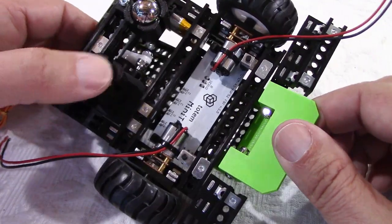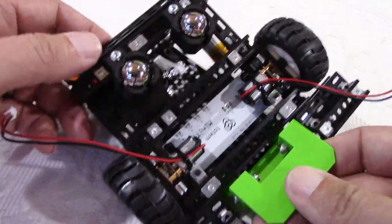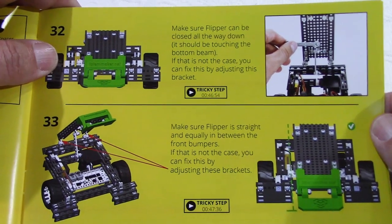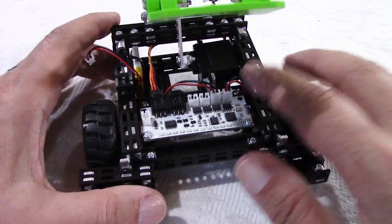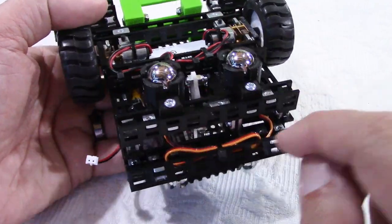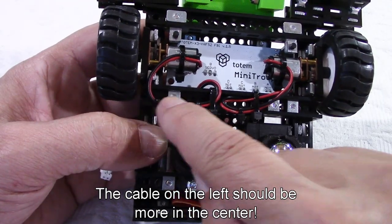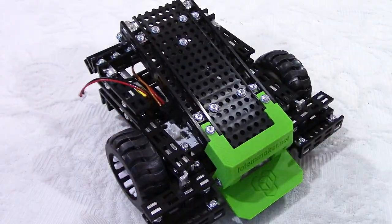In step number 31, we install the two ball bearings in the back and the two wheels on the two motors. Steps 32 and 33 show what you need to do to make sure the flipper moves perfectly. Finally, at the end, we make all the connections — the servo goes in here, the two motors over here. And if we look at the cable management in the back, I basically did what they show in the manual. I have the servo cable hidden in the back. They provided two zip ties for that, but I added three — I have lots of them — so I could route the cables a little bit more to my liking.